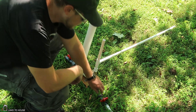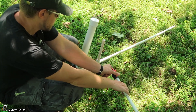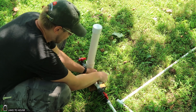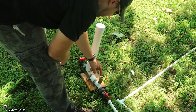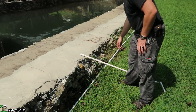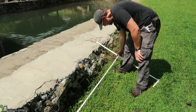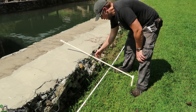There's potential for a lot of air to be in this pipe, so it may take some time to purge that. It's being very difficult to purge the air out of the line. Either that or this line is just too long for the pressure wave. So I'm going to disconnect right here and install this stand pipe, which may actually be just a little bit too short. We'll give it a try here.